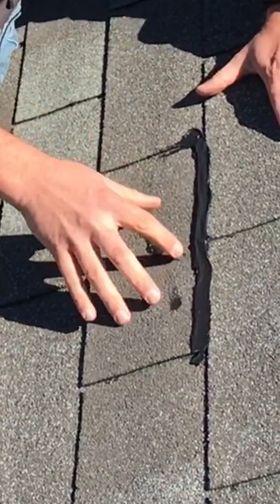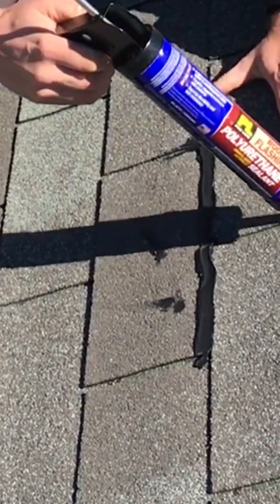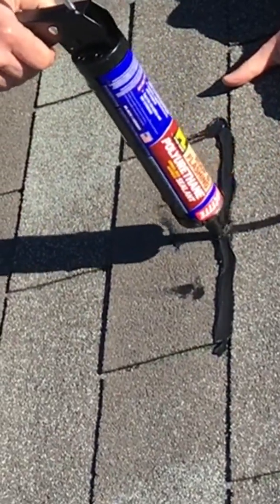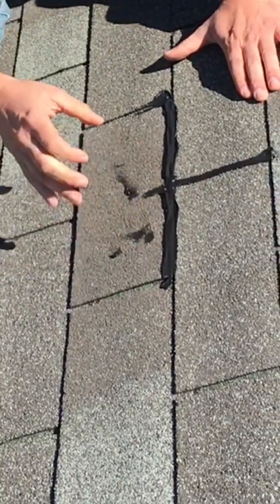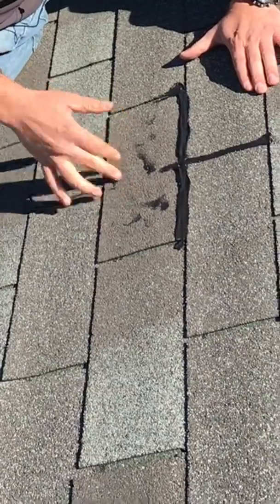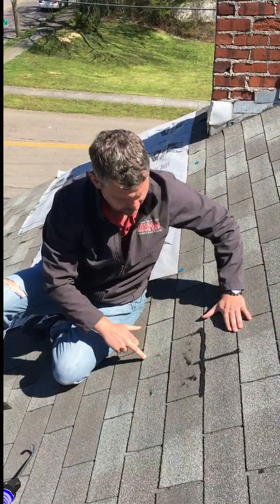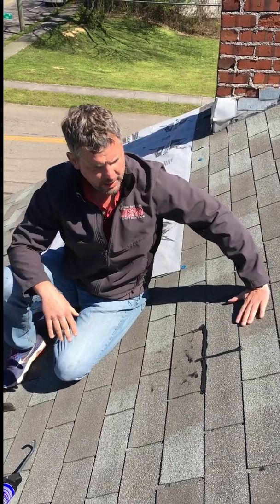This fractured shingle can stay in place. You might even want to hit the union up above so that there's no chance that water can get in there. This is a great temporary repair, but there's really no manufacturer that's going to say this is an acceptable long-term repair, which is a little bit more evidence to be able to discuss.